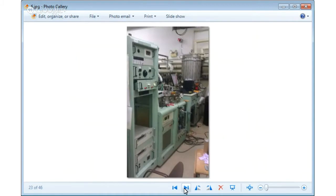This is the project I'm currently working on. This machine is from the 1950s and was actually used to test the Voyager 1 mission — the last test they ran was in 1988. My job was to figure out how it works, make it better, improve it. I took all the wires apart, figured out how it works, made schematics for it. Then I made a fixture to mount some high-resolution stepper motors so we can scan a thermocouple sample every 10 microns, giving us an idea of the material distribution of the entire pellet.